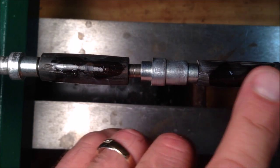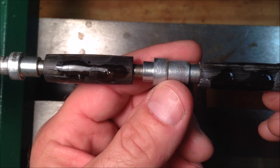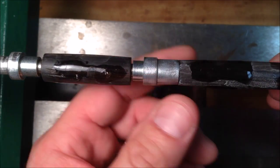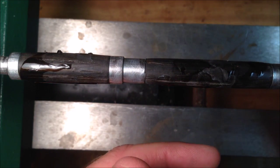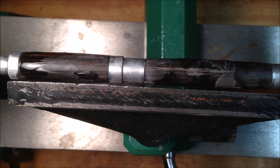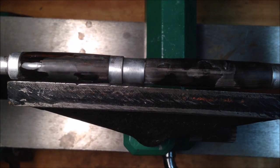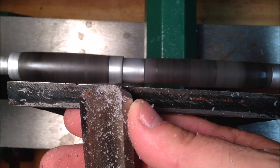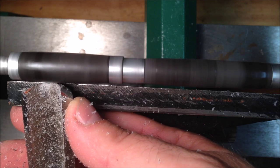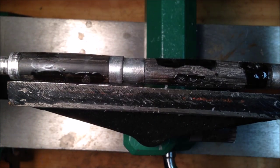My CA glue is dried — I'm ready to start cleaning up the blanks a little bit. I have it separated from the bushings because I didn't want to take a chance of it drying to the bushings if some of the glue got on them. So I'm going to go ahead and put this back on the mandrel, get everything back between the bushings, and let's clean it up. As nervous as this makes me, I'm going to fire the blank up and go ahead and use my spindle roughing gouge as lightly as I can — just to kill the high spots — and then I'll come back and use some sandpaper.